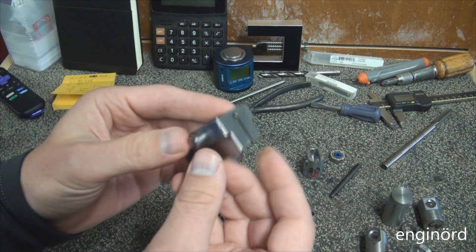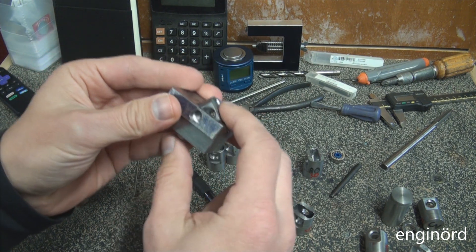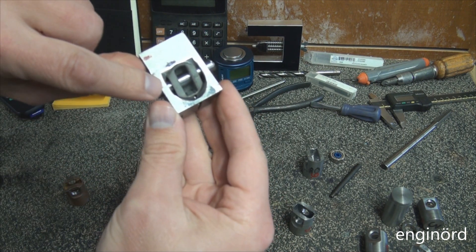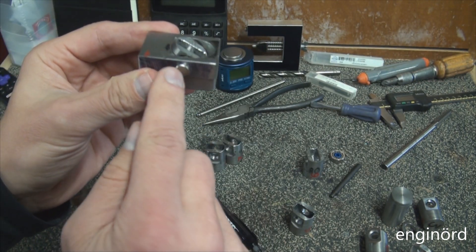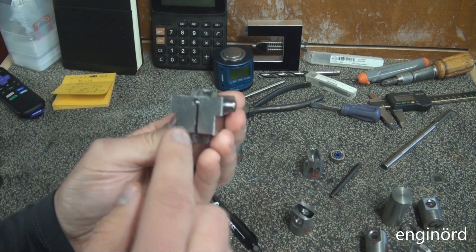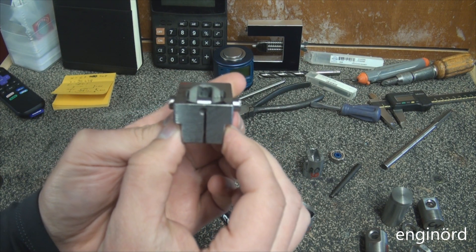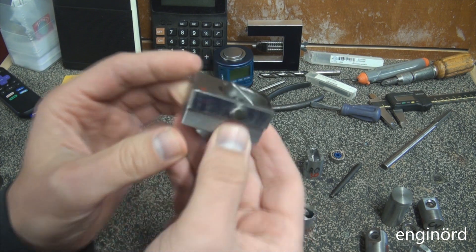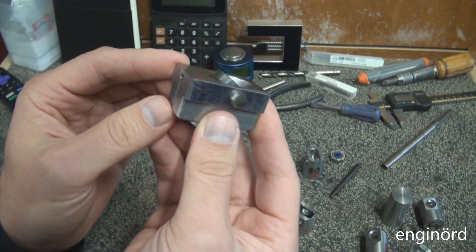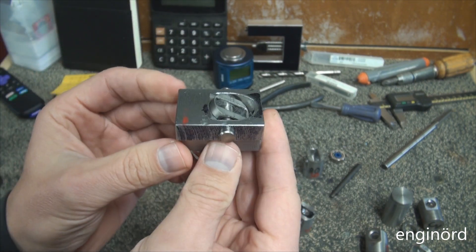So I came up with this little vise. The way it works is I pop in a part like so, and then there is a pin that aligns the pre-drilled hole in the tappet with the hole in the vise, with a certain amount of clearance. This guy has a living hinge, so when I squeeze it in the vise it will not go anywhere. It holds it like there's no tomorrow - when it clamps on, there is no vibration, nothing, it just does the cutting.